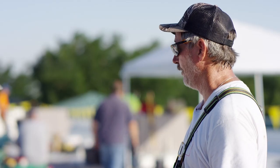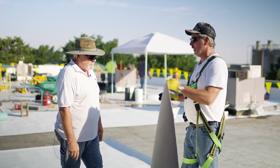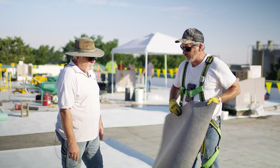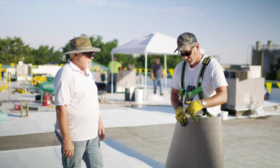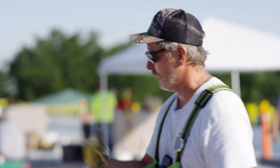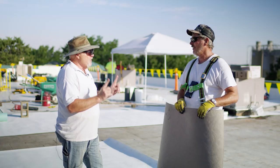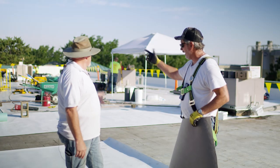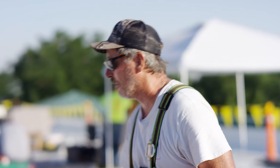What we're using here is fleece back — this is our fleece back membrane. Here's the top side, and the technical term for the back? Fuzzies. So basically we have a poly mat there which is a separator, but this membrane has the separator already built in — one sheet. So you don't have to cut the poly mat when you go around units, you cut the sheet once.